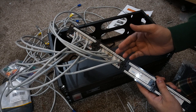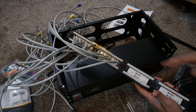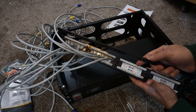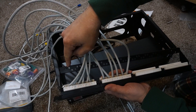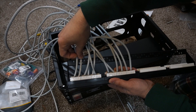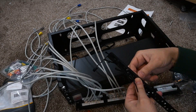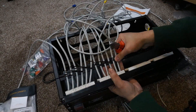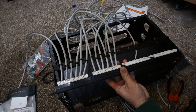All the patch panel connections I need at this moment are done. I've got 12 spare ports remaining for future use. Now it's time to tidy up all the wiring using the cable management rail on the back — just slide it in. I can then use tie wraps to make sure all cables are tied up neatly so nothing breaks or comes loose when cables are moved.